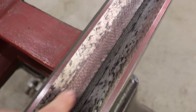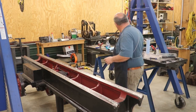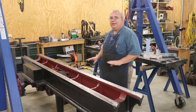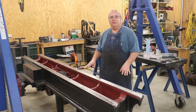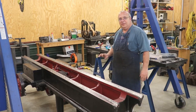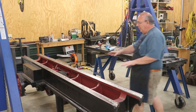As we walk down there are definitely some variations in points per inch in one place versus another. But I've gotten to the point where at least everywhere we're getting some points of contact for at least a third of the way if not the entire distance. Down here on this end we're getting contact up top, not as much in the bottom, but it picks back up toward the end — and that's good enough. There are a lot of points of contact over this eight-foot table. Now one question that has come up is: why did I have to do so much scraping on this? You had this thing ground.